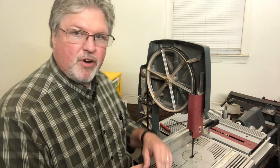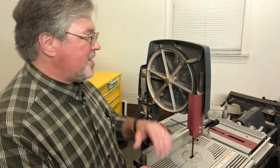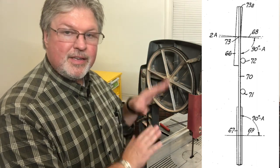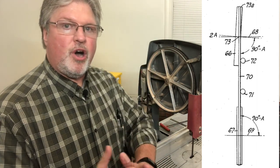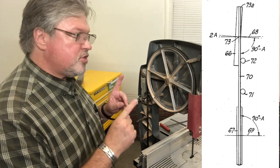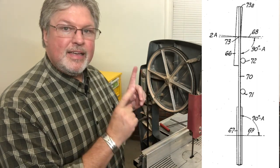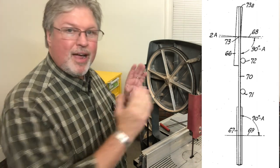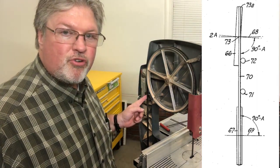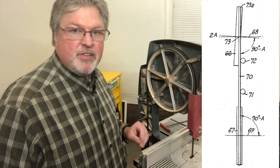You'd have a hard time measuring it, but it's there. This upper wheel, instead of being adjustable like every other bandsaw to provide tracking adjustments, is tilted backwards — it has a slight cant. This is part of the patent: the patent for an auto-tracking bandsaw. The idea is when you put your blade on, it's going to want to track towards the back, and if nothing stopped it, it would track all the way off the back of the upper wheel. What prevents that is something called the auto-track bearings.